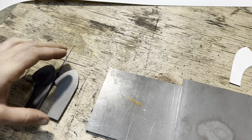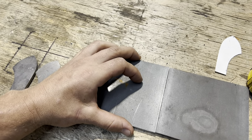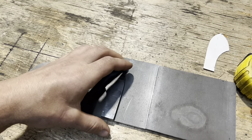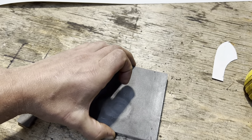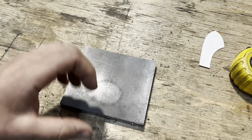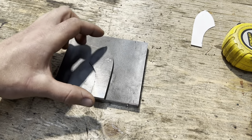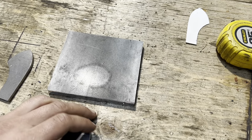this into the metal. So now what we've got to do with these plates is create a clamp essentially that will have this in a negative cut out of it. So we'll be able to stick our sheet metal on here. We'll be able to put these together. You can either clamp them, you could drill holes and put bolts through them to hold the two plates together. And then with this window cut out, this will set in there and then we'll be able to hammer it down into the next piece.